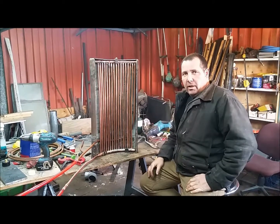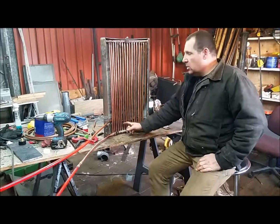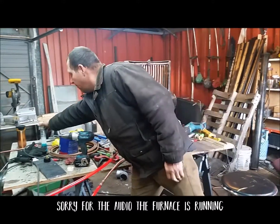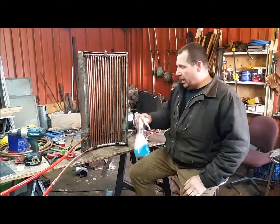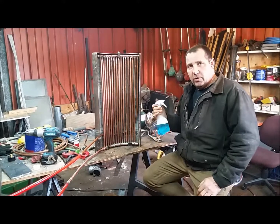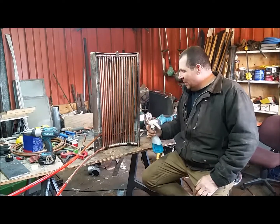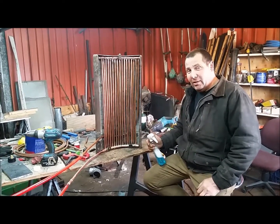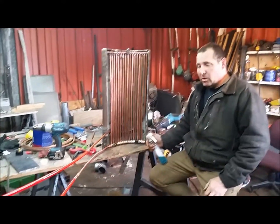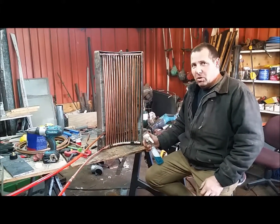Hey guys, Kyle and I are back here with the rocket stove modifications for the heat coil. We added our last pieces of pipe and got it watertight. What we did is go around all the joints with some soap water and put pressure on the pipe with a compressor and watched for air bubbles — we found probably a dozen of them because the soldering is not all that pristine. It's not pretty but it's hidden, so not a big deal. We got it airtight with no more bubbles, and we're going to try and install it on the rocket stove. Eventually we'll have hot water flowing through this.